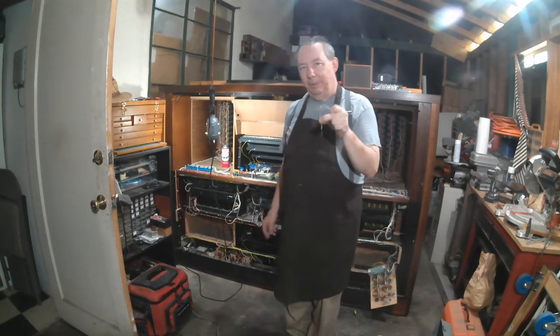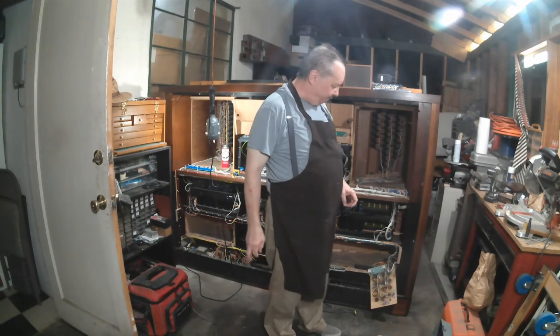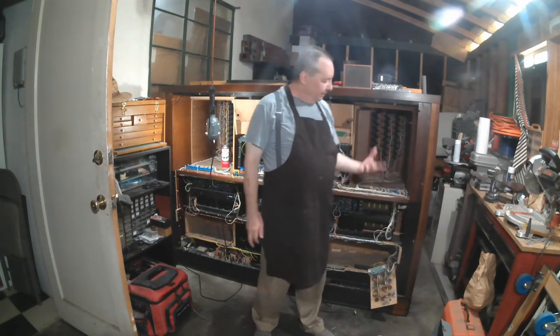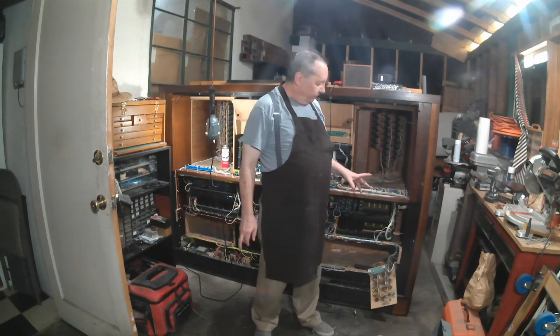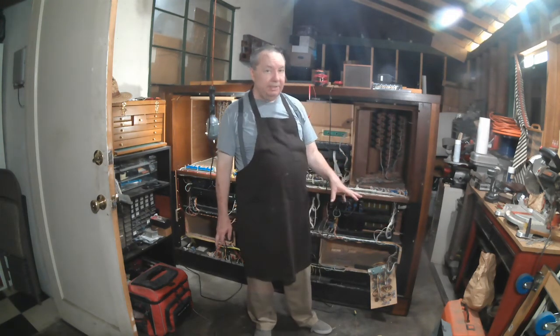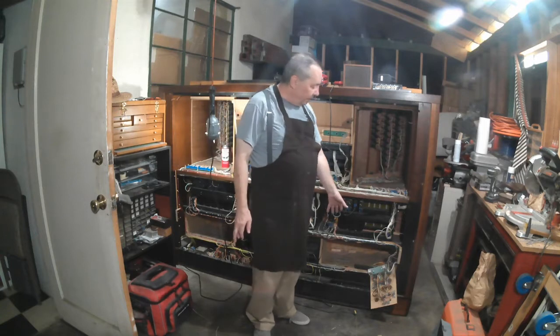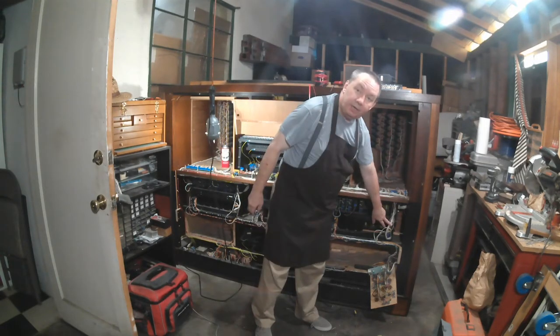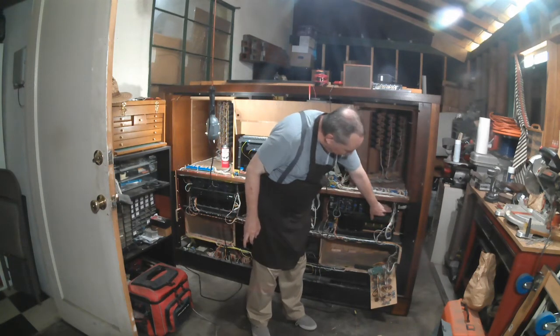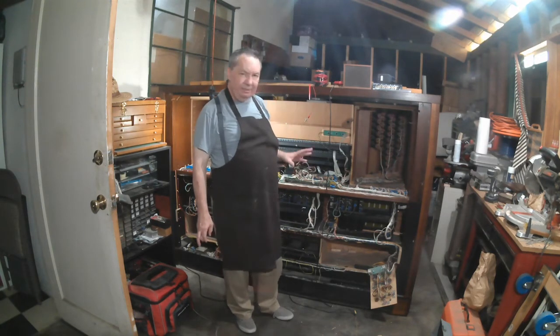I made a Facebook post about doing this, and a couple of my organ technician friends really didn't like that idea. They said there's got to be some other way — why can't you just tap into the audio? The issue is I don't know that the audio signal before the amplifier is really a complete audio signal. Does it have the expression control in the mix or not? Or is that handled at the amplifier level? If it's handled at the amplifier level, I'd lose my expression pedals by tapping the audio there. Also, there's not a lot of room where these audio output cards are, so tapping this would be very difficult and challenging.